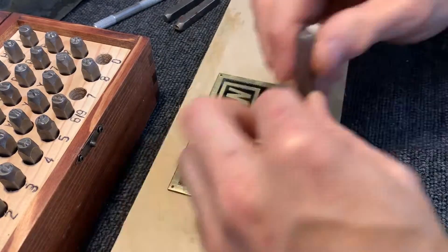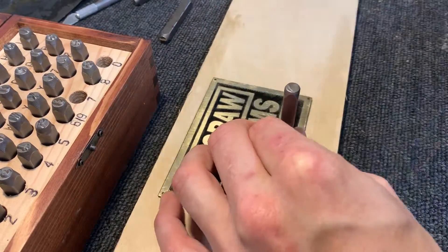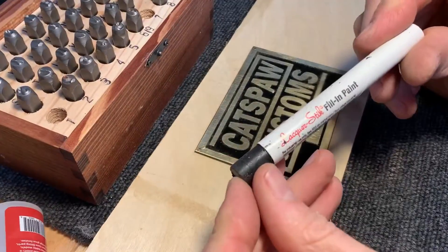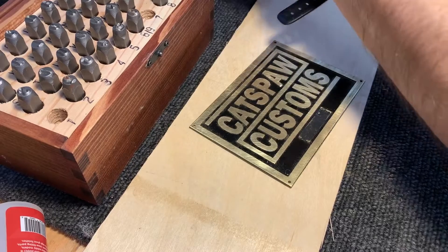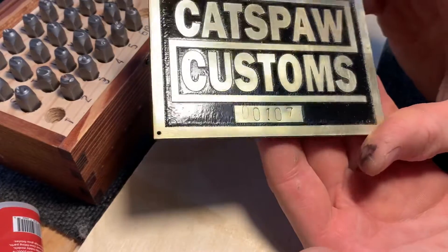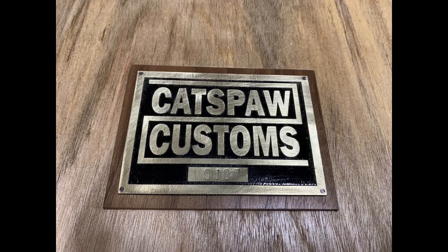Finally I did a really crappy job of stamping a serial number into the brass. This works a lot better if you have something harder like cast iron underneath the piece of brass instead of plywood, and also with thinner brass. Punching the letters on straight also helps. Anyway, this is how you know it was handmade. This is something new that I tried to get those numbers just a little bit darker — it worked okay but I think I need a little bit more practice with it. And with my acid etched serialized brass maker's mark plate done I attach it to the piece. If you made it this far I hope you found this video helpful and informative. Thanks for watching!